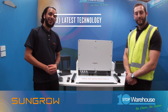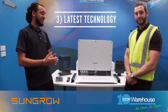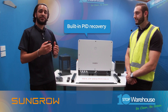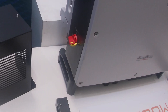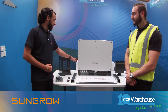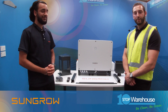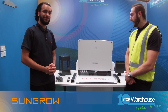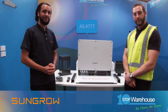That's made possible through the IM4C dongle that comes with the inverter itself. You simply plug it into the main inverter and you're good to go. You're able to access the platform through Wi-Fi on the dongle and make all the adjustments needed. Point number three: the CX inverters come with all the latest technologies. Firstly, there's the PID recovery function which gives the inverter increased energy yield. All inverters also come with a built-in DC isolator switch, compliant with all Australian standards — ERAC level 3 listed in the database, with AS5033 and AS4777 compliance.